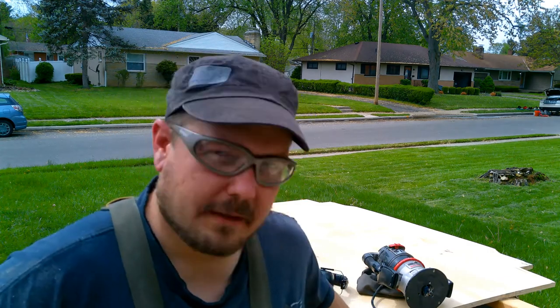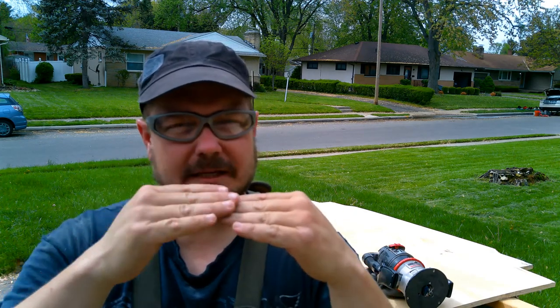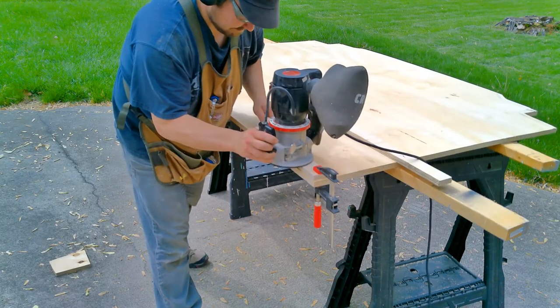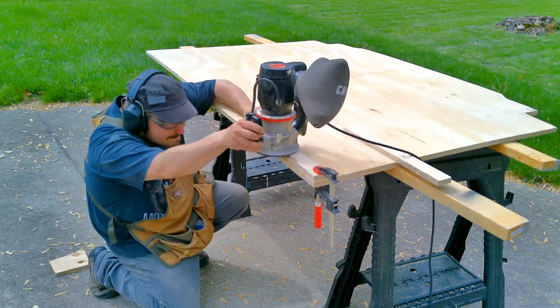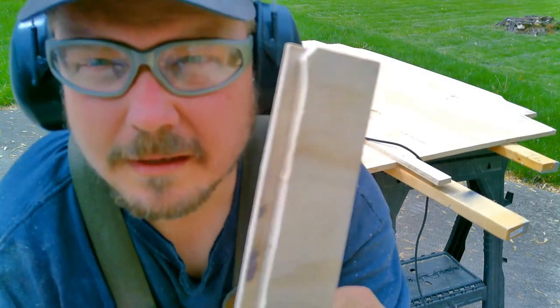The last thing I need to do with this piece before I cut my next one is cut a channel into it. The reason is that when I step on it, I don't want there to be any seams — I want it to seem seamless and I don't want anything raised. So we're going to do that now. First I'm going to do this on a practice piece to make sure I have the depth of my router set properly. There's my channel.